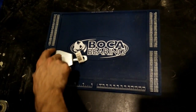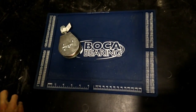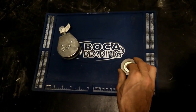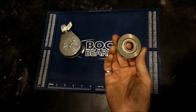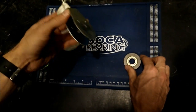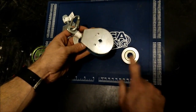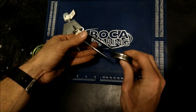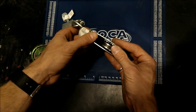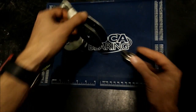We have our standard pulley from Home Depot — it's meant for rope, but there's way too much friction. We've got some grooved bearings from Boca Bearings, and we're going to use that Kevlar rope to support us. To convert it, we'll take apart the old pulley and use the housing with the new bearing. We'll drill the hole out to fit a shaft, put a shaft in with a cotter pin, and make some recessed washers to snap onto the ball bearing to keep the Kevlar rope from slipping. Let's start building.